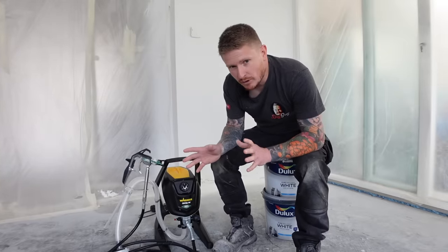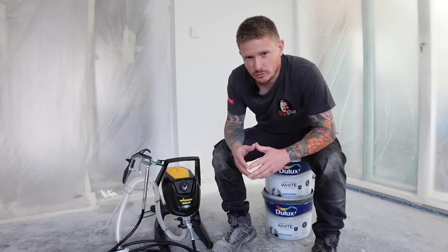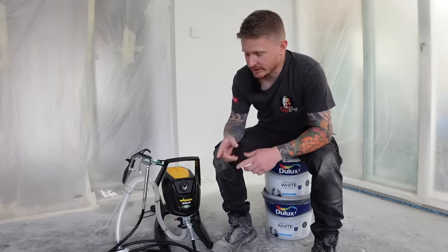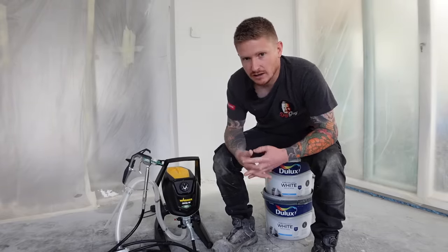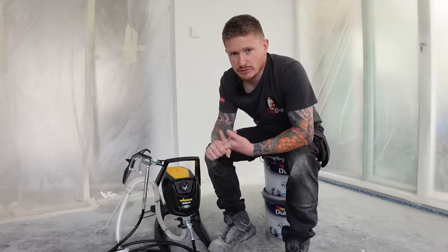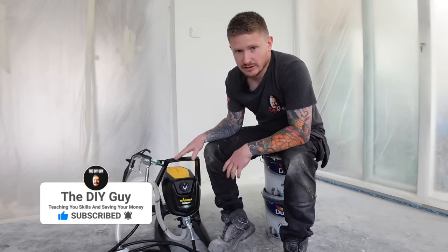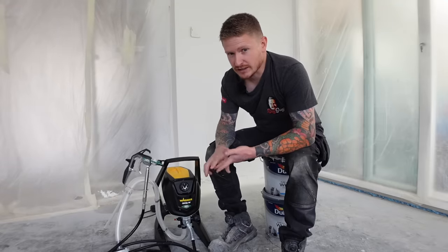Hopefully that gives you some idea of how much is involved in cleaning out one of these airless sprayers. That brings us to the question you're probably wondering: would I — or should you — buy one of these airless sprayers, in particular the Wagner 250R? Well, the answer is yes, no, maybe — and the reason is it depends on what you need one for. If you're doing a lot of big rooms, working on a renovation like I am, or doing lots of fences, then I would not hesitate to buy one — they're quick, the finish is great, and they're really good fun to use. But they're not perfect: the main flaw is that they take a long time to prepare and a long time to clean out, which means they're only really worthwhile if you've got quite a bit of painting to do. There's no point trying to paint a small room or just one wall, because it'll take you just as much time to prepare as it does to actually paint the room.